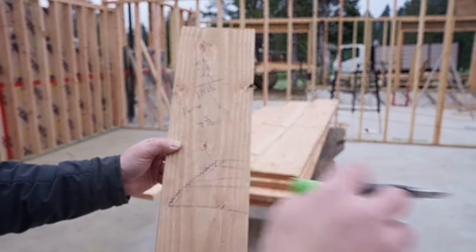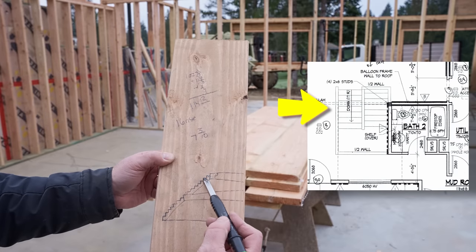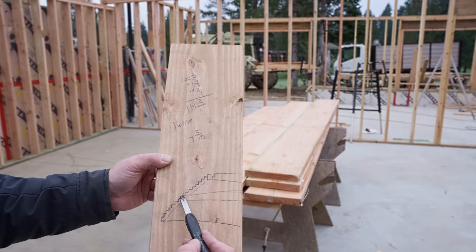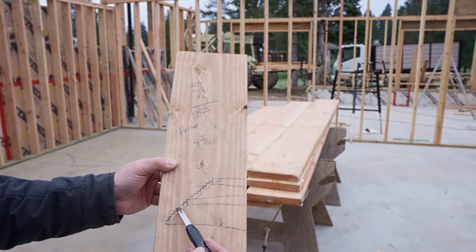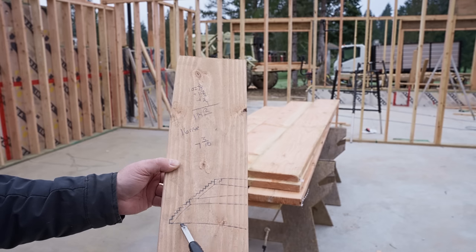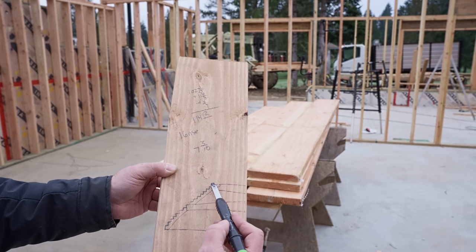Now, based on what I knew over there with the stairs, I counted 7 coming down from the top. 1, 2, 3, 4, 5, 6, 7, draw that line. That means platform, draw that line. The remainder, 1, 2, 3, 4, 5, 6, 7. Draw that. So basement slab, platform, the rim or the upper floor joist, and then of course, top of floor.